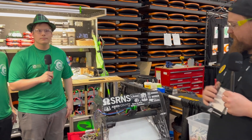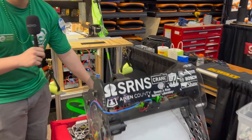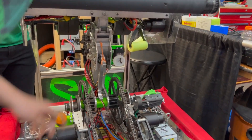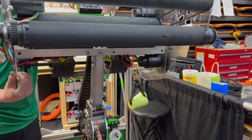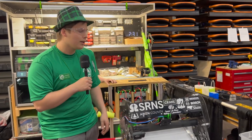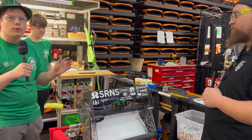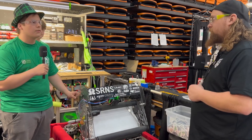So to get us started, Xander is going to talk to us about the robot. One of the biggest subsystems on this robot is the telescoping arm right here. It telescopes — it's a little tough because we have a high gear ratio on it. We took some heavy inspiration from the Unqualified Quokka's robot in three days, but we wanted to be a little more compact and go under the stage without our intake hanging out the front. We decided the best way would be a mechanism that allows our arm to come in and out. The big CAD discussion was sitting down and weighing the pros and cons of a wrist versus this telescoping arm.